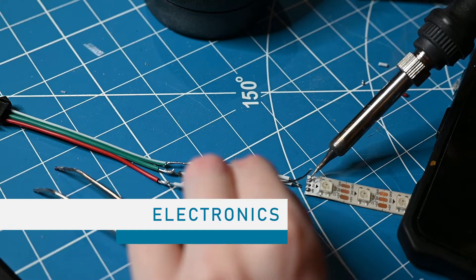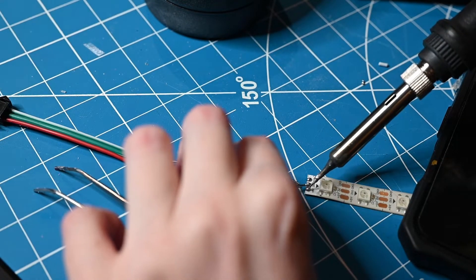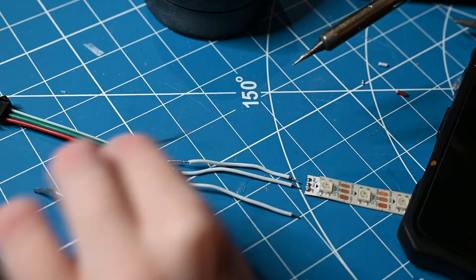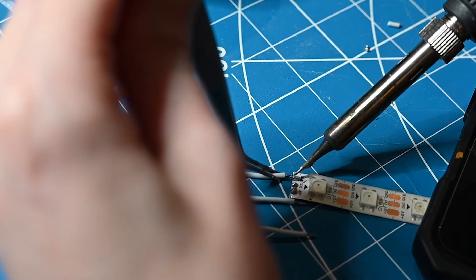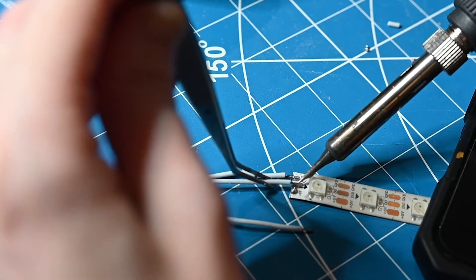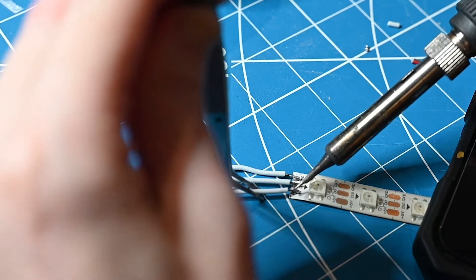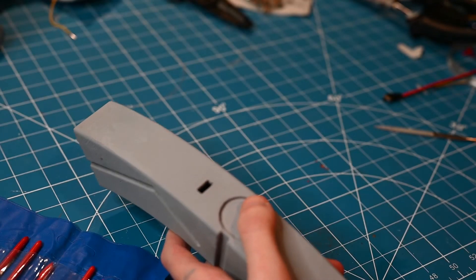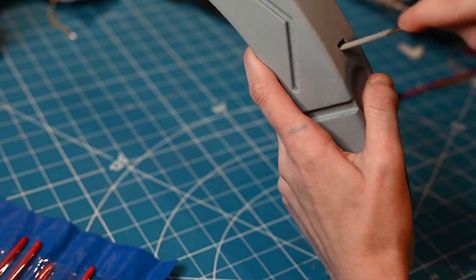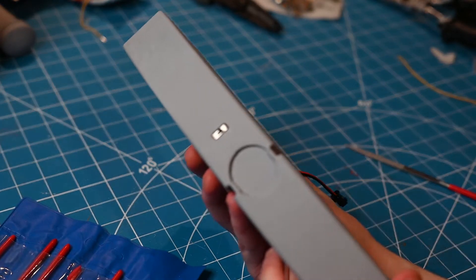For electronics, I used the same setup as my previous build. I just had to solder the JST connector to the correct length of LEDs. The best way to solder LEDs is to add some solder to the wires and the copper connecting pads, then lay the wire on top and place the soldering iron on the wire — the wire will sink into the pads and form a connection. Using the same setup makes it so much easier for cons because I just need to upload the already saved code from the laptop to the microchip for whatever animation I need for that specific prop. I do have two of these setups because usually it's a prop and something else on my cosplay will light up.